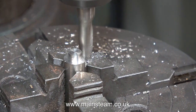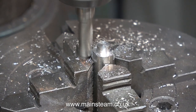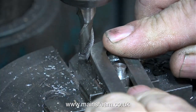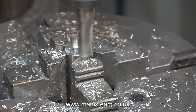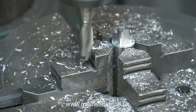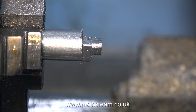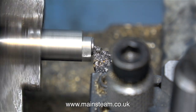Although before you can finalize the position you need to make one of these — a very small but important part, and a very simple machining and milling job. In the lathe I reduced the diameter of the end of a piece of steel bar until it was a very good fit in the quadrant. In this clip I'm using the turned part of the bar as a guide, then running a milling cutter down each side, allowing the cutter just to touch the round part of the bar so the square part will be a good fit in the quadrant. I've machined this part square on three sides. After cleaning up the edges with a needle file the part is back in the lathe and I'm removing the round part entirely.